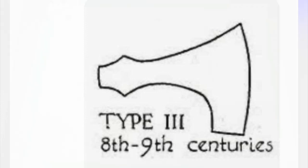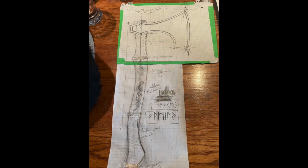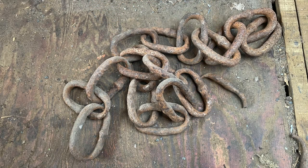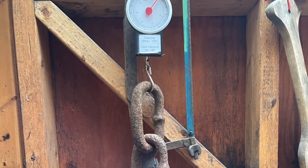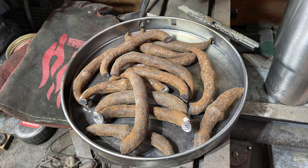I made up a quick drawing and went away from the traditional handle with something a little more curvy, with a leather wrap top and bottom. Made the main axe head out of wrought iron chain — old logging chain — about 7 pounds of it roughly. We're going to cut that up into pieces, and then throw those into the forge to get them straight and flat.